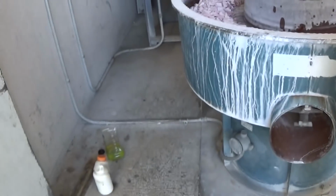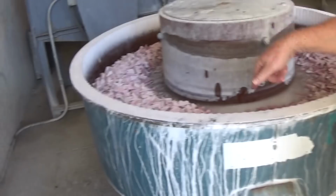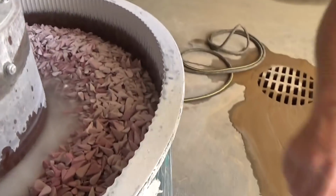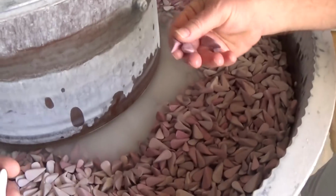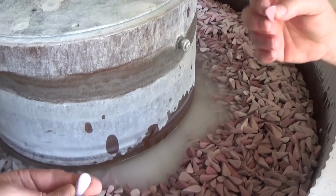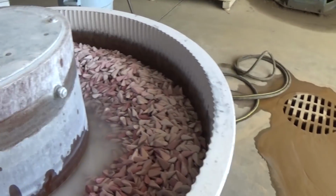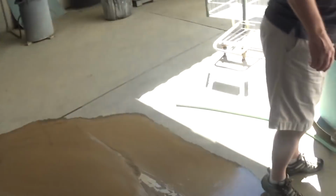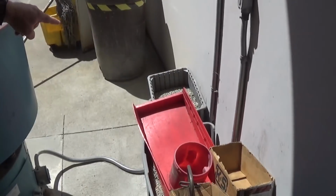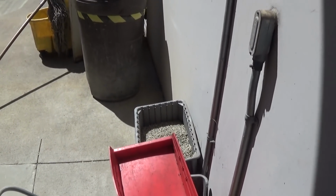Well, this is an agitator like you'd have in a washing machine. Yeah, right. But everything just kind of tumbles through. Yeah, I see. And then these rocks are of various shapes and sizes for different parts. This larger size is to make sure that they don't fall into some of the holes. But then we also have smaller material and smaller pellets. So if there's no holes in a part like that, that's where that smaller size might be used.